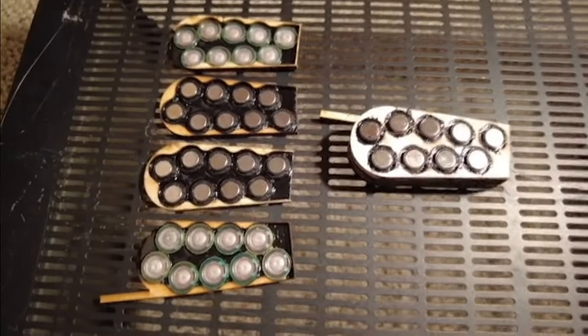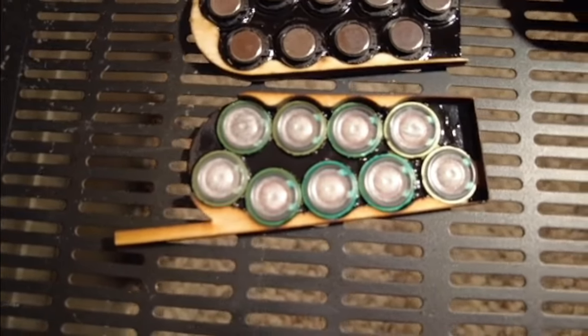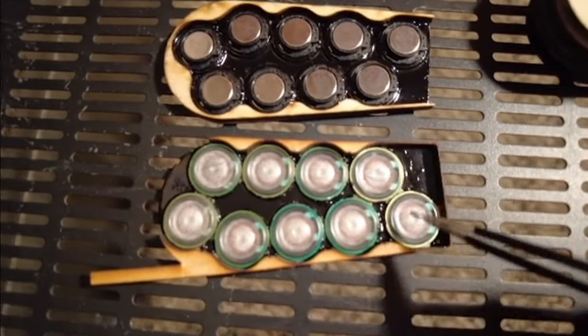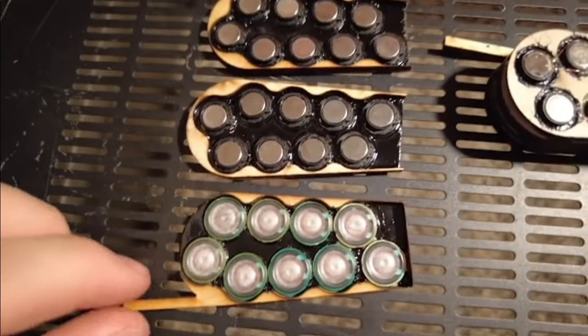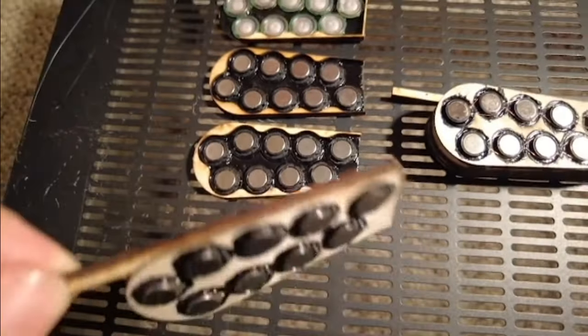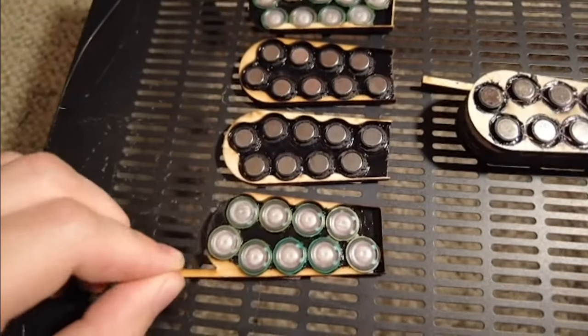This is a detailed view of the inside and design intention of the speaker modules. Each speaker module has 4 layers with 9 speakers in each layer. Since the glasses has 2 arms, this means 2 speaker modules total for one pair of glasses. The layers are composed of Baltic birch wood with the 12mm drivers glued in with super adhesive.